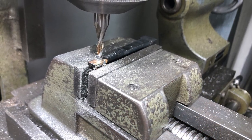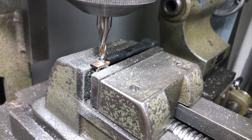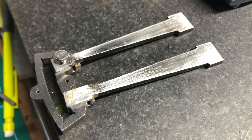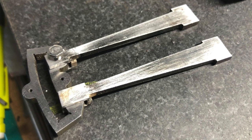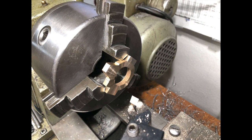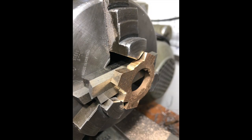What I struggled with was determining how to set this up to get a square base of the fork. In the end, the easiest way with the equipment I had was to cut those slots as you see in the image and then file square the base of the fork to make it fit. While that was a little bit tedious, I got quite accurate results and was careful with the filing. Accuracy was the priority here as far as the fit for the moving parts and correct clearances.